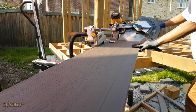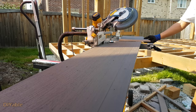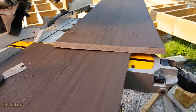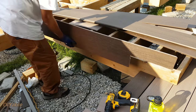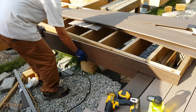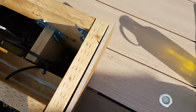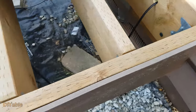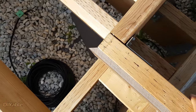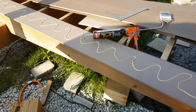Let's continue the project and work on the bridge. You always want to cut a 45-degree miter joint to make the edge look professional. Measure it and cut it with precision — it's not too difficult. I am just a DIY person; if I can do it, so can you. In the last video I talked about two ways to install fascia boards. This is the second method: using construction glue and screws.